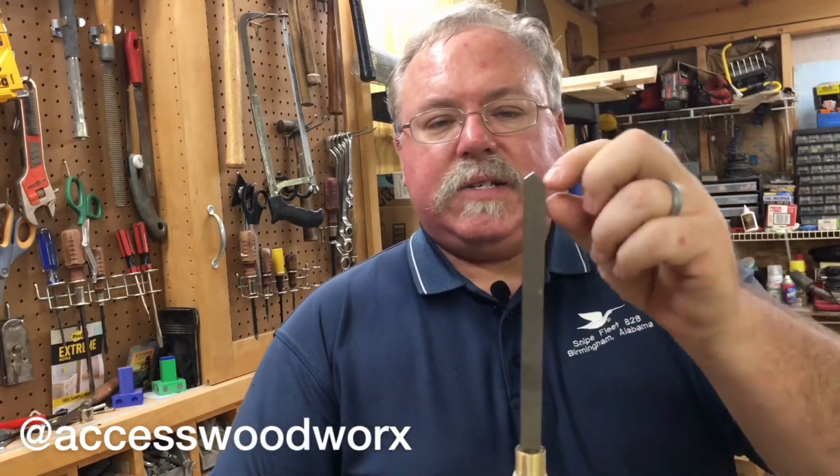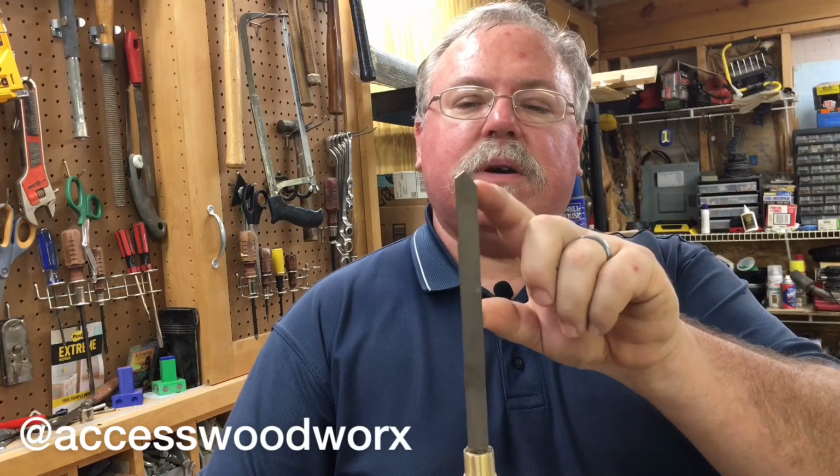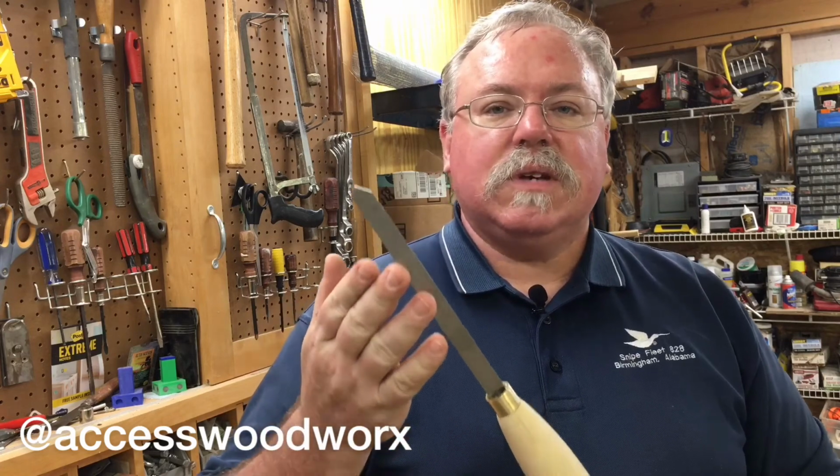So we've got a nice 90-degree end on our scraper, and that will help us hopefully turn better mortise and tenons for making bowls. Hopefully the next video I make will be demonstrating how to use this to make a bowl with nothing but a faceplate.